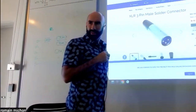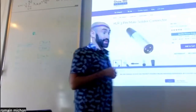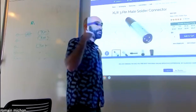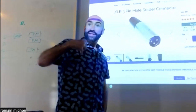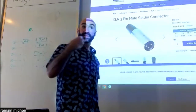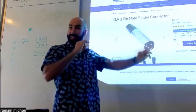So why do you need 3 pins? It's still a noise issue. If you need to send an audio signal over a long distance in a cable, shielding is not enough. You're still gonna get some noise in the cable because your cable is starting to act as an antenna.